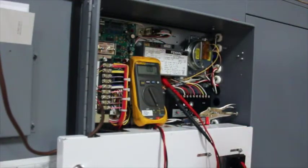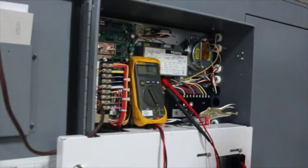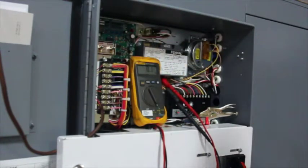At this point, turn your disconnect switch back on. Set the blower switch to local and the blower will come on. Once the blower is on, turn the burner toggle switch to the on position. After a few seconds, it will fire. At this point, monitor your flame signal and verify that it is adequate — you are looking for a 3 to 5 micro-amp signal.